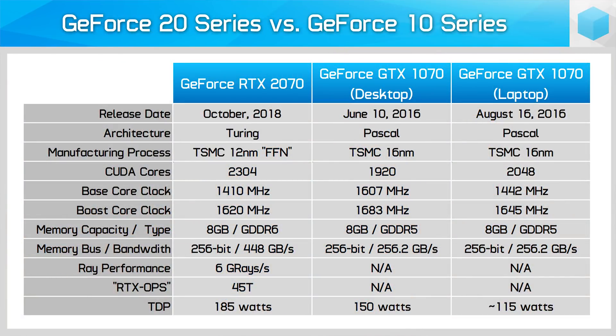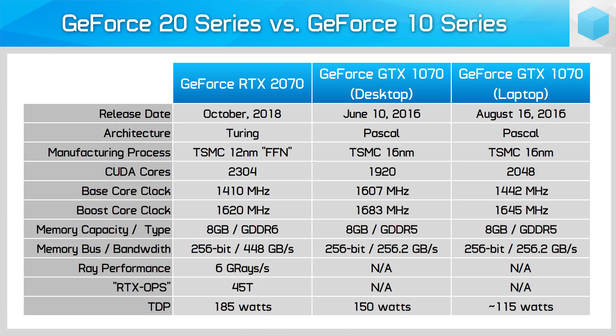At the same TDP, the RTX 2070 should be able to provide more performance than the GTX 1070. Whatever laptops could support the 1070's TDP will be able to bump up to an RTX 2070 and get more performance in the same form factor — great news for mobile gamers. The 2070 includes 2304 CUDA cores compared to 2048 in the 1070, all thanks to the shift from 16 to 12 nanometers. On paper that's a 12% performance jump, though it's looking unlikely the 2070 will reach the level of the GTX 1080. Any performance increase in a constrained laptop form factor is very welcome.